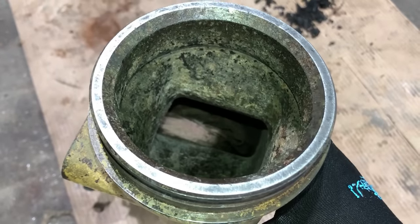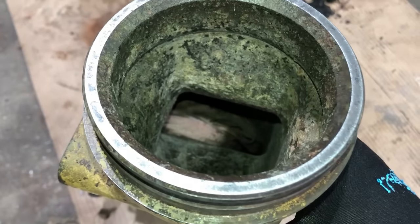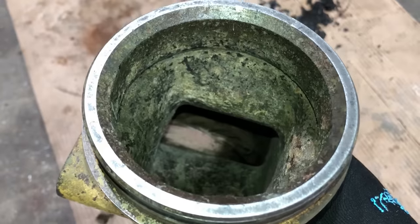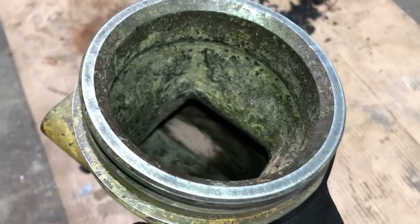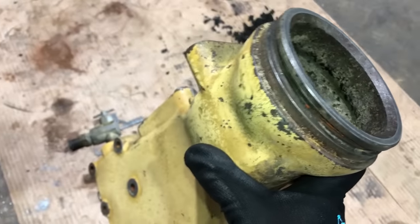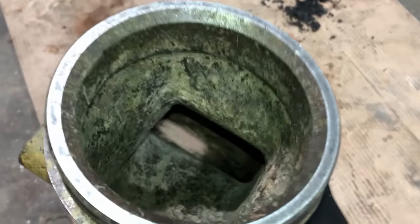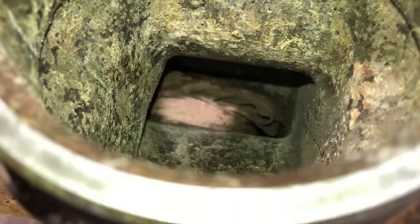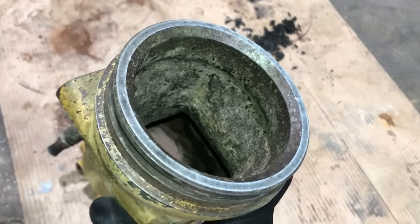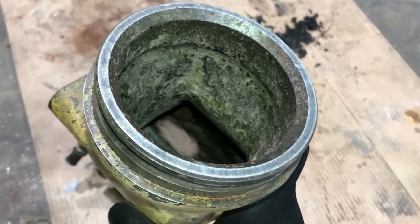And that core, you could tell, or I could tell when I was tearing it down, it had obviously been overhauled pretty recently. I would say probably didn't have more than 100,000 miles on it, but it just didn't look very good. The head was cracked up worse than they normally are, and a few of the liners were scored up. I mean, it looked like it had been hot, and it's no mystery why now. I guarantee you the whole time the guy had that engine and was running it, he was trying to figure out why it ran so hot and probably had it back in the shop more than once. Nobody could figure it out.